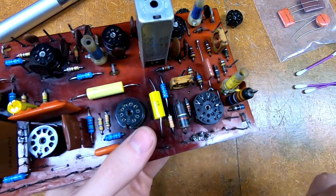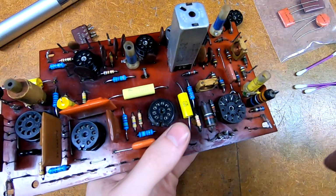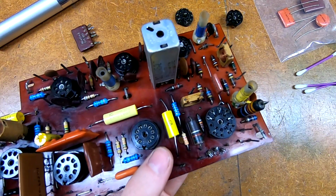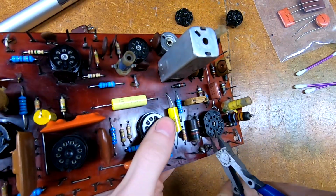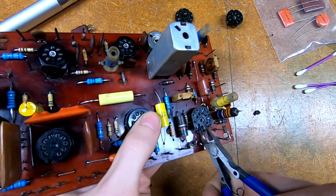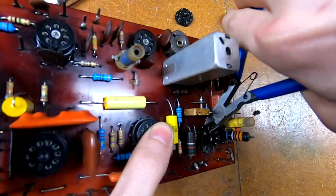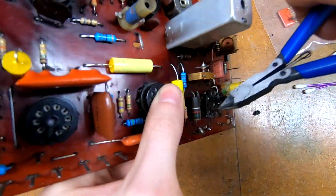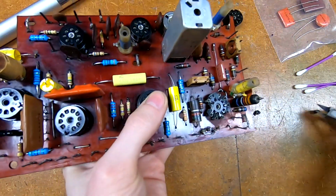But if you don't feel like going through the slow process of desoldering the back and then trying to clip each pin, especially since you can't get around there, thanks to the excessive amount of heat that these sockets had to endure, they actually come apart very easily. So the simplest method of eliminating them is to simply destroy them. Because at this point they are basically made of graham cracker. They're pretty brittle. It's another good reason to get rid of them.